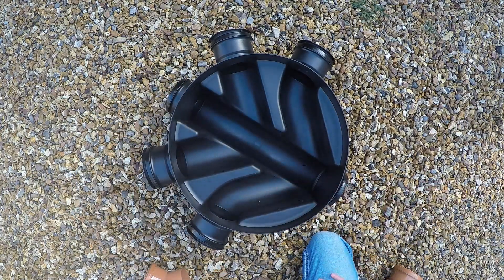At either end you would use a 45-degree in and a 45-degree out to make a nice long sweeping 90-degree bend, which is a lot easier to clean and maintain. Hope that clarifies the point. Thanks for watching — more information on the website at www.drainagesales.co.uk. See you again soon.